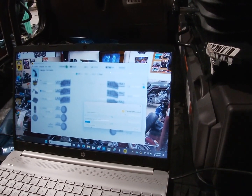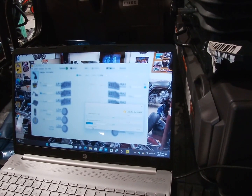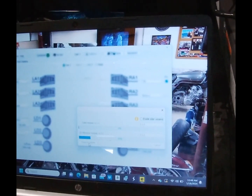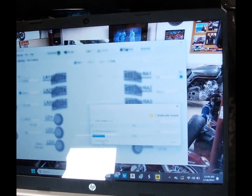You hold that baby button in for 10 seconds and it'll switch to shear mode. Then you pick your grapple up and operate your grapple without the tilt rotator being on. I getcha. That's what you mean by shear mode. It's bi-directional.